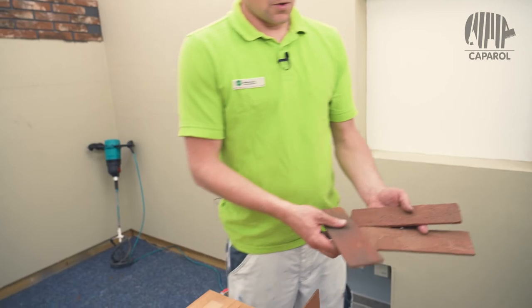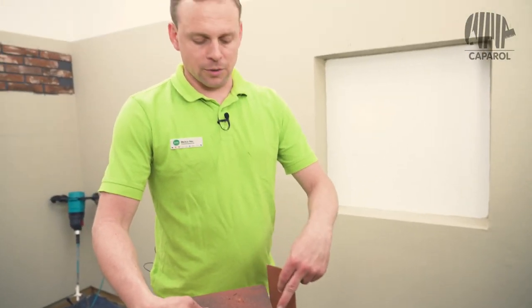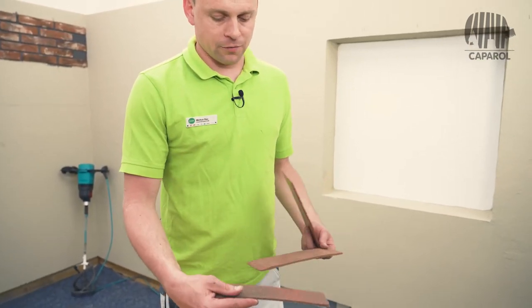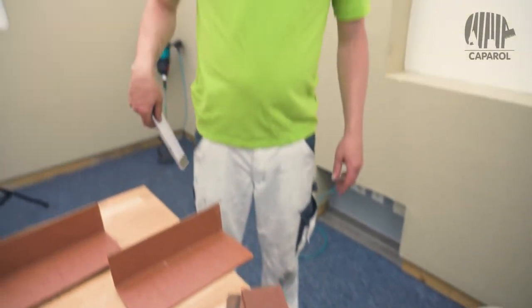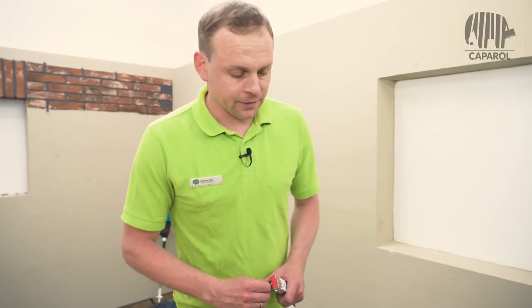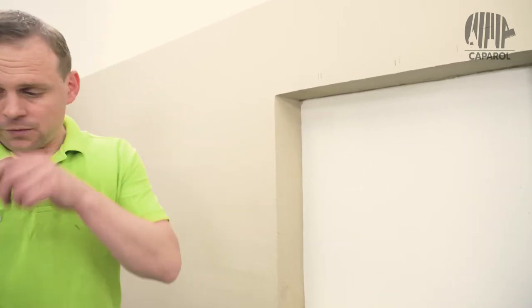Each stone is unique, is made by hand and has the dimensions of 71 mm high and 240 mm long. With its 71 mm, this format is higher than the last one, which was 52 mm. Therefore, our work area must be adjusted. For this, the dimension must increase.